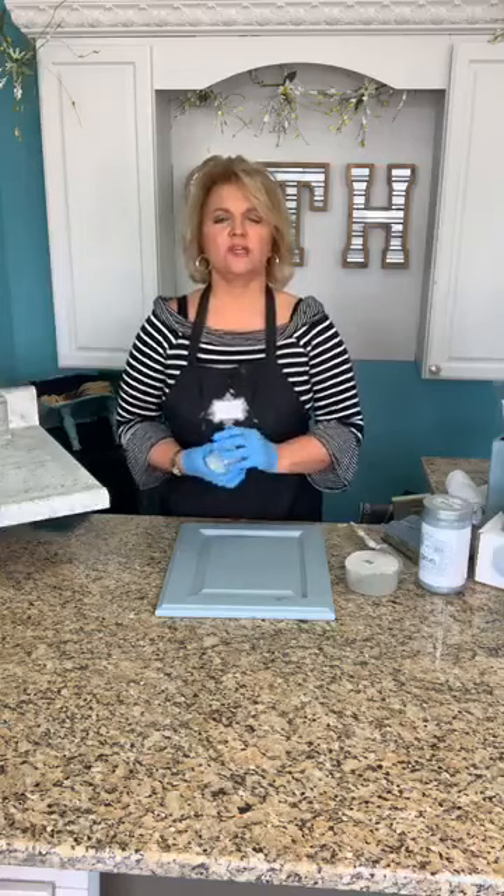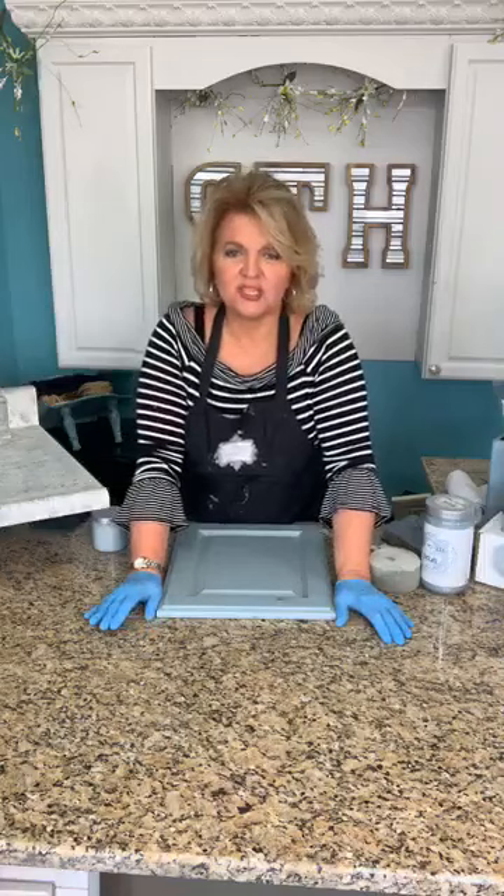Let's talk about touching up. When there's an issue, the key word is prep. If you're having your paint chip away — and this applies to other paint products too — if you haven't removed the grease, surface oils, and build-up, you're going to experience chipping. You'll generally see that in one place: the handles and hardware. That's because when you're cooking, you have grease on your hands and you reach for things, and when you clean around hardware you generally don't get it all.